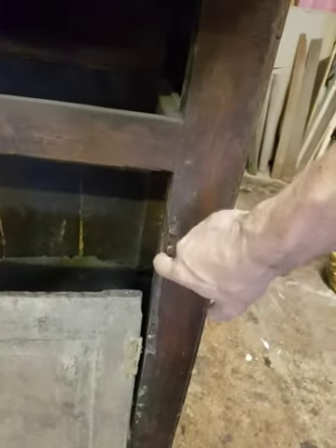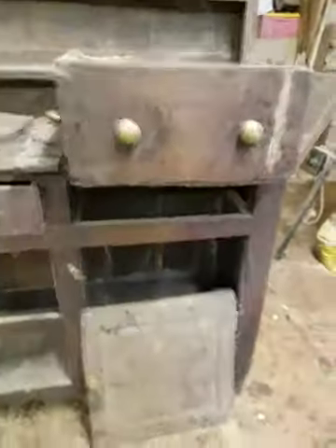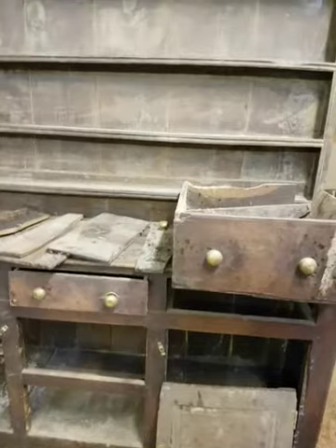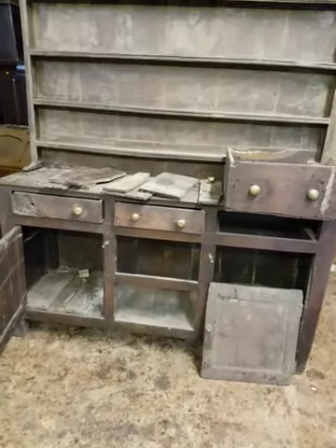Things like this — I never understand how they actually happen. It has a hinge on there and when somebody slams the door it'll whack the hinge off. Originally it would have had pin hinges at the top running up through this section. So what we'll have to do is put it back to the way it should be — get rid of these later hinges and the metalwork on it — and put in some sympathetic pieces matching the actual date of the dresser, which is a nice 18th century piece of furniture.